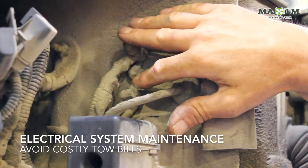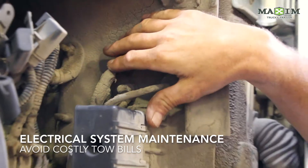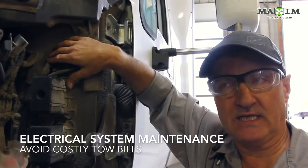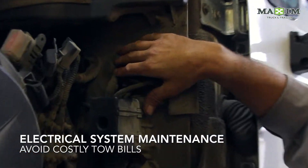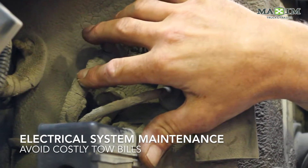These up here are the main cab grounds, along with a lot of other systems that connect back to this cab ground, because it has a main cab ground back to the battery. The batteries are going to have to be kept clean and tidy, and your ground cables need to be kept in the same condition. Ground can be just as important as your power cables. If you allow them to become dirty and loose, they will give you lots of trouble.